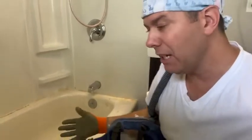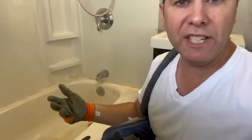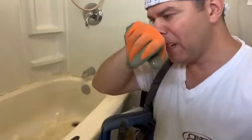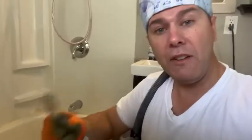I've got two coats on. Sometimes I might have to clean it all again, sand it down with the machine, then put another coat of stripper — that'd be the third time — wait 15–20 minutes, let it dry, scrape it again, and see what peels off with the razor blade. You just keep repeating that process until it's all peeled off. Eventually it gets soft enough to do that, but I've had to do it three times before.